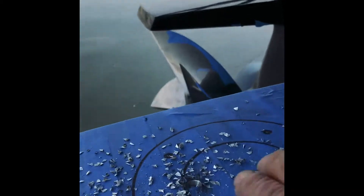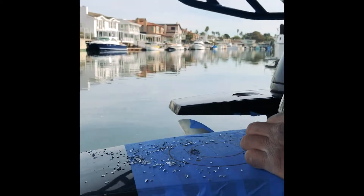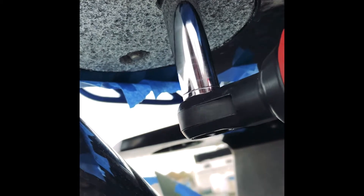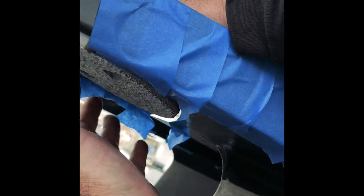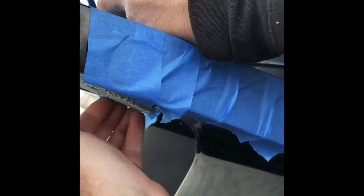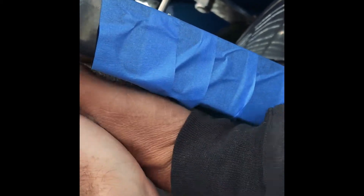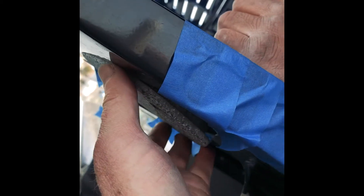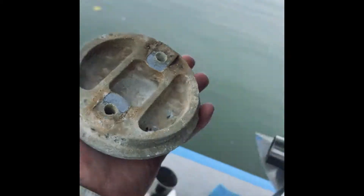That's our second hole — the first hole was the pilot hole, now we do a little bigger one so a good-sized screwdriver can fit in there to knock the anode free. Now I'm going to take the nuts off the bottom of the anode. We knocked the anode out — it was going sideways for a moment but we got it. The anode is out.